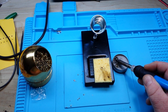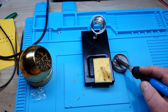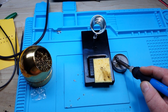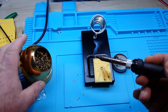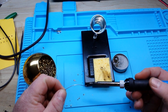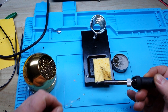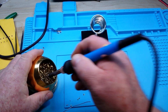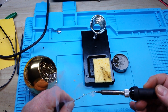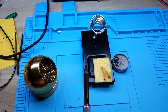Let me try it one more time. So perhaps the claim that this stuff will restore a heavily oxidized soldering tip is just not true. I mean, you can see I'm giving it every opportunity to do what it can. It has made a difference but hasn't made enough of a difference. I think this tip is probably pooched from that damage.